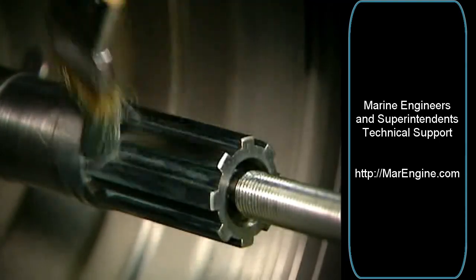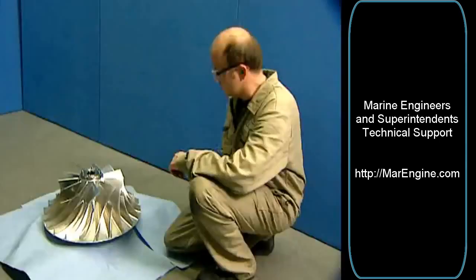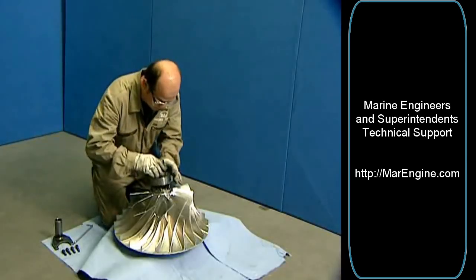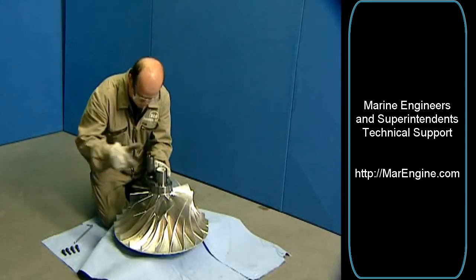Place down the wheel onto a wooden support and remove the suspension device. Clean the splined profile on the shaft and in the compressor wheel thoroughly. Copy the balancing mark of the compressor wheel to its inlet surface. Mount the slide and the lever carrier on the compressor wheel.